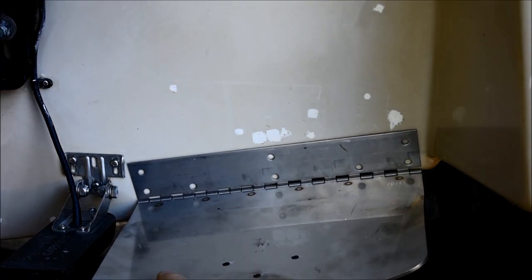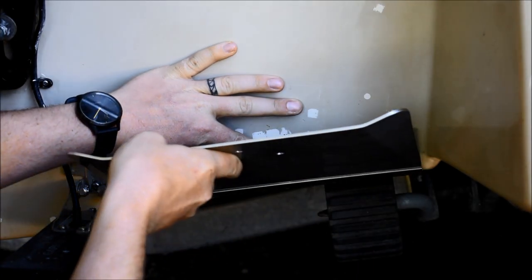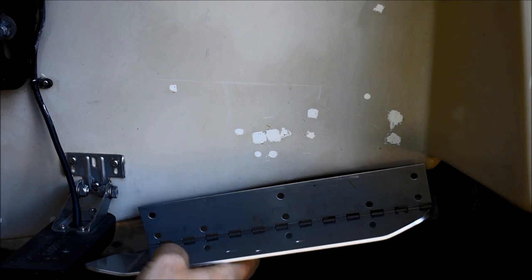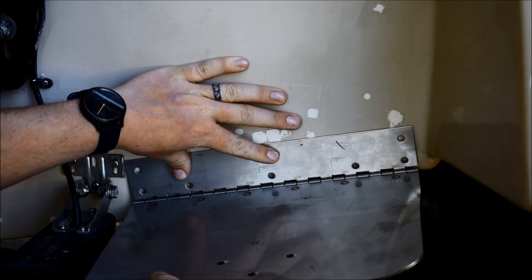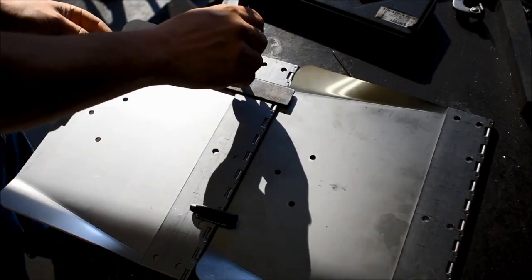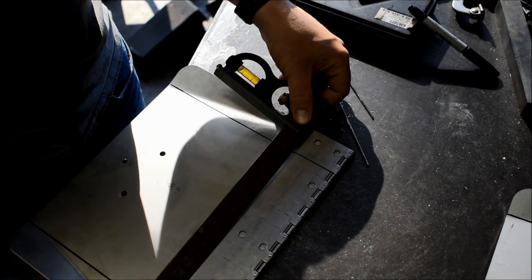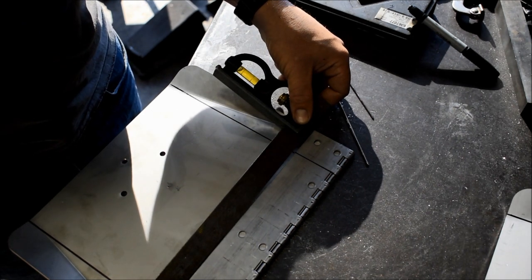As you can see, we're pretty close to the fish finder transducer, and also the chine on this side is just too close. So we're going to take probably an inch off each side and mount it up. It looks like these are going to end up being about 9 by 9 trim tabs. I chopped a little bit extra off, but I think it'll be just fine.